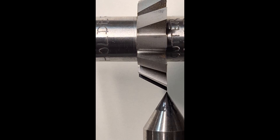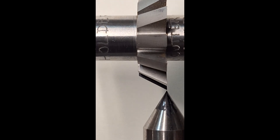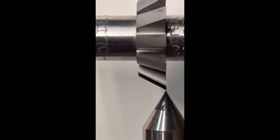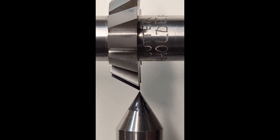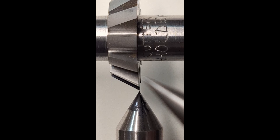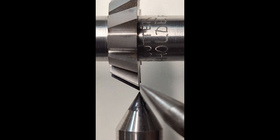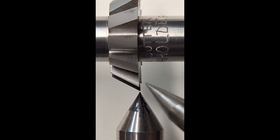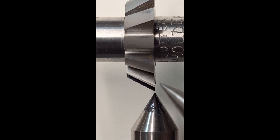I'm rather painfully aware that my description of centering the rear of the cutter may have been a bit unclear. What I've tried to do here is mimic with the camera in my mobile phone what's going on as you move your head to the rear of the machine. The flat side of the cutter nearest to the centre — this is all magnified up because it's a very small cutter and a very small centre, but this is trying to mimic what you see through an eyeglass. If your eye line is actually behind the centre line, you can see the rear face of the cutter appearing in your vision — an ever increasing view of the back of the teeth — which shows that you're too far back.